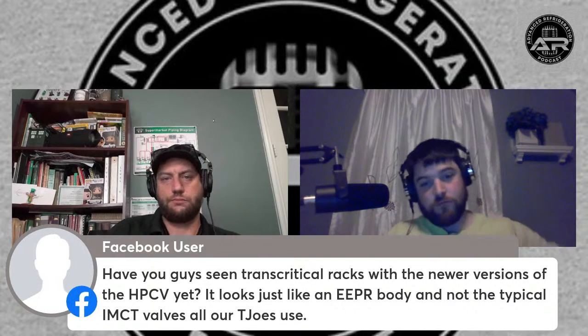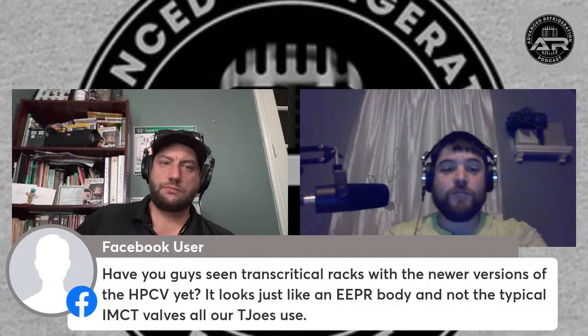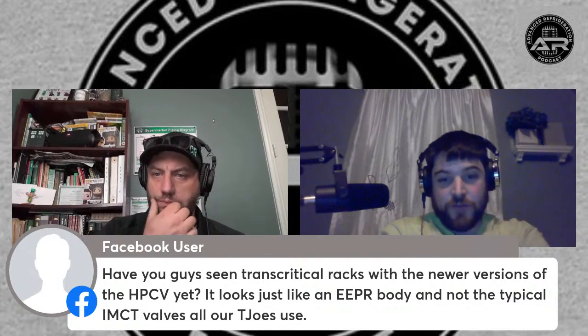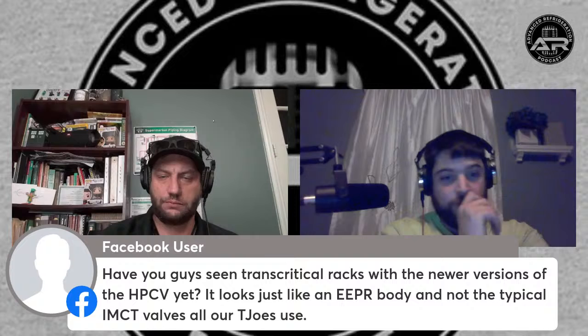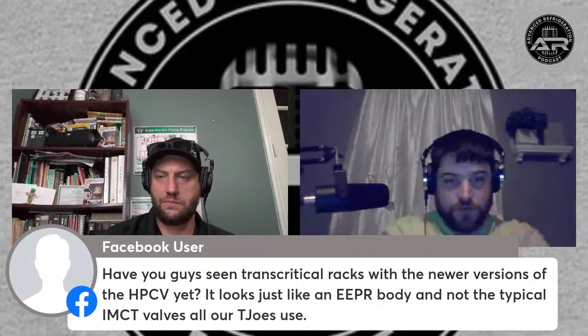So I just wrote it so it would step the valve off a 0 to 10 volt signal inside the E2, and it was modulating the high pressure valve that way. That rack ran like that for like 2.5 weeks in the middle of summer with zero issues. So I mean, the two valve system like that gives you a little bit more flexibility with it.